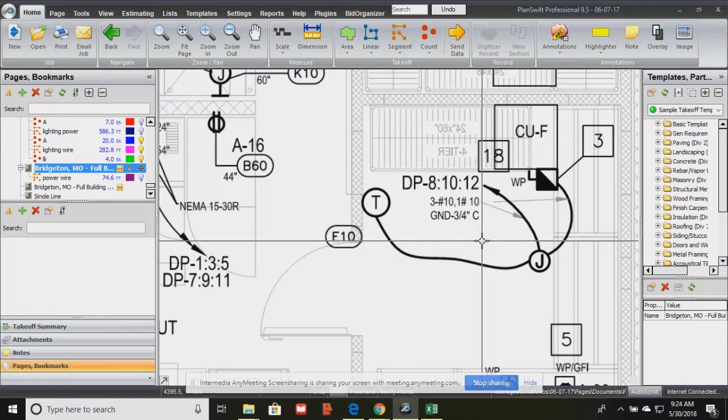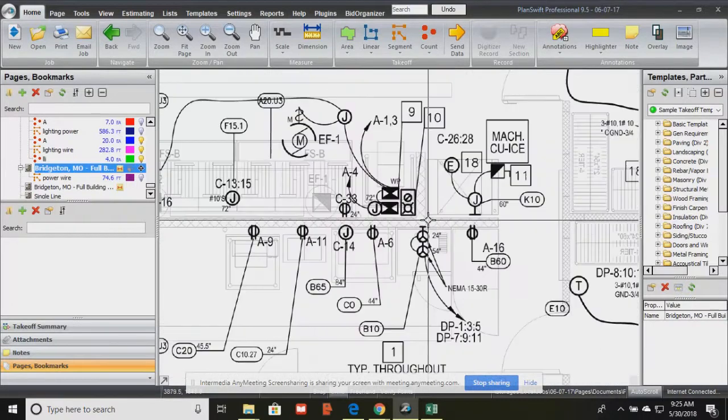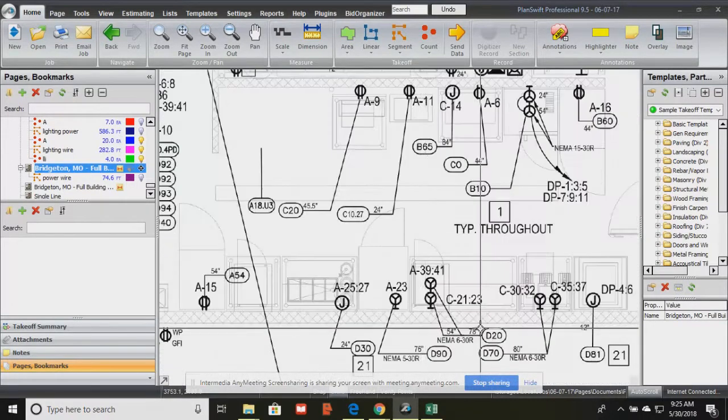Okay, so the only way to change and to give the power requirements for the condensing unit or for an exhaust fan or for whatever, they have to make those adjustments in the wire. Now, why doesn't everything tell you the wire size? Because typically, if you look in your power notes, and electrical is a pain in the butt. It's a whole lot of stuff, I know. But it is and it isn't. So typically in the notes, it'll tell you the wire configuration generally, unless otherwise noted. For that condensing unit, it was otherwise noted, so we know to run that. Well, usually it's 3 wires that's required, and they usually use number 12.